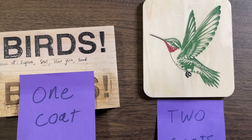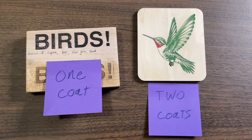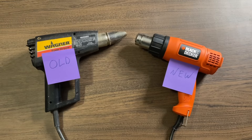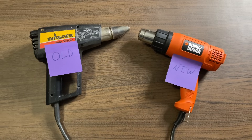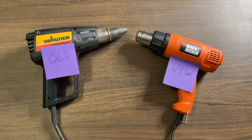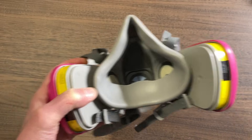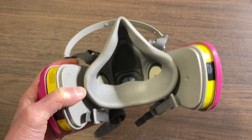When applying any paints — including acrylic and powder paints — I think it looks better to do two coats. This is especially true for lighter colors because the black engraving underneath is more likely to show through. Keep in mind that if you do multiple coats, you should do all the coats before sanding or removing the mask. If you use a heat gun method, make sure to use a good heat gun on its low fan setting — I first tried an older heat gun that didn't get hot enough but had the fan on high, so it blew about half the powder away. And whenever doing any paint melting techniques, I always wear a respirator just to be safe.